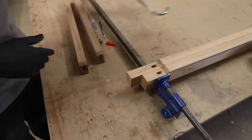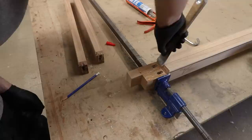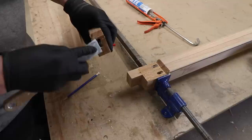And also there's a certain stage when it's going off that you can clean it up a bit easier than if it's fully gone off, especially with this Wood Weld stuff. It seems to go off so hard so quickly. If you glue something up and leave it till the next morning to clean it up, it's a bloody nightmare to try and get that swelled-out residue glue out of all the joints. It's set so hard, you can't even get a sharp chisel in it. It just fights you all the way.